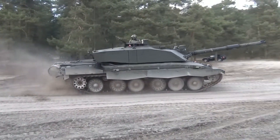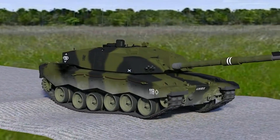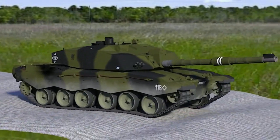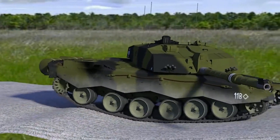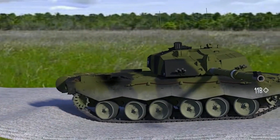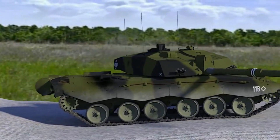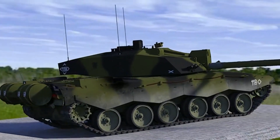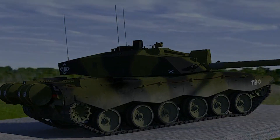The final con for me is price. These units aren't exactly cheap compared to torsional bar systems, which are basically pressed steel in a bar form. We're talking about a sealed unit comprising gases, oils, the arm itself, different seals, castings, and the bottle — it all adds up. For 12 units, if a lot of them fail, it's a lot of money and comparatively expensive to the torsional bar system. However, modern main battle tanks are stepping away from torsional bar systems, and they work very well at creating that nice stable platform and keeping tanks rolling cross-country.